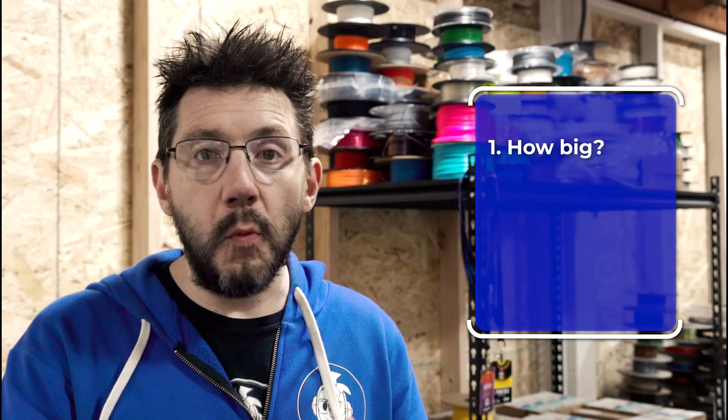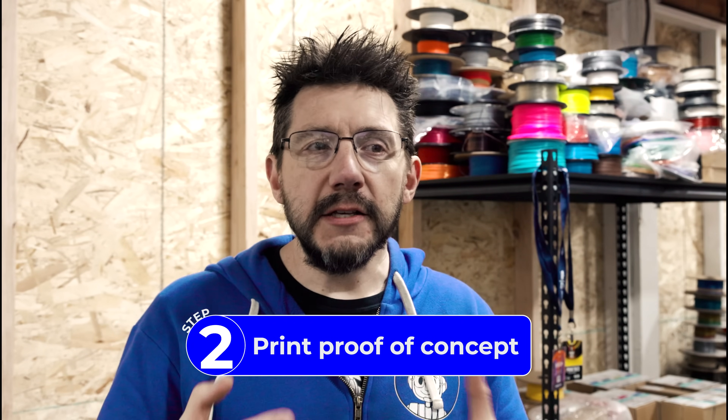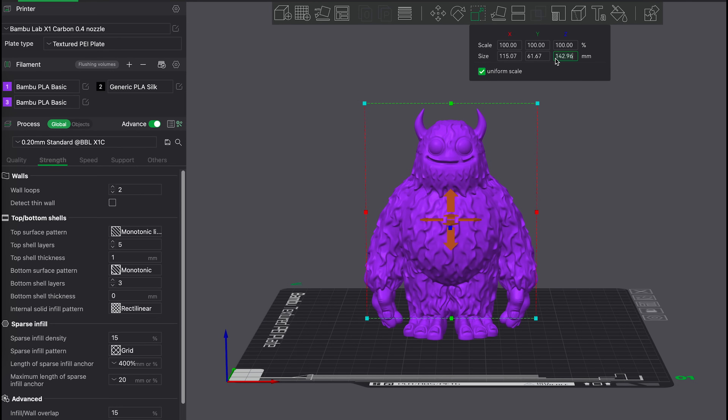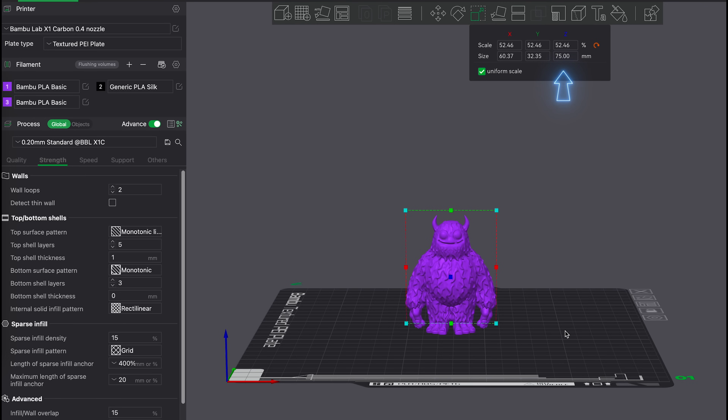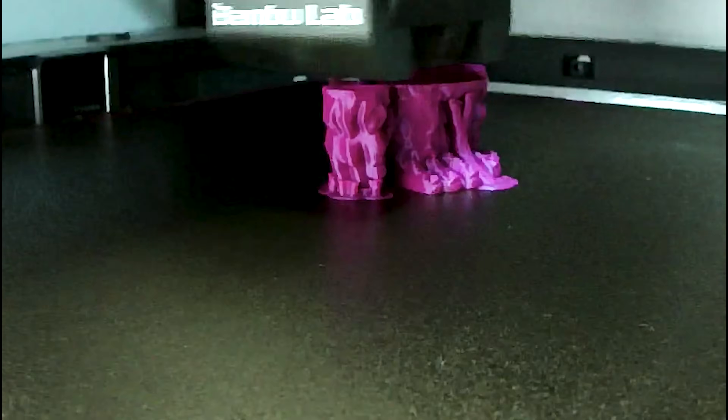I did some calculations and I'm going to show you what I did. Step one is planning your crop, and the crop in this case is this specific Yeti model for Fandom Zone Comics to be given away at Emerald City Comic Con. In planning this, we need to find out what size we want the model at, what print settings are going to work at that size, and whether supports are necessary. Then we print one or two proofs of concept to get buy-off from the customer — in this case, my friend Joel. I took the Yeti model down to 75 millimeters tall, used auto-generated supports, and printed out a few of them to see what he thought.